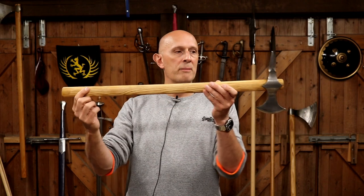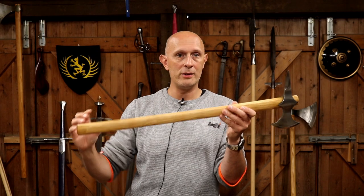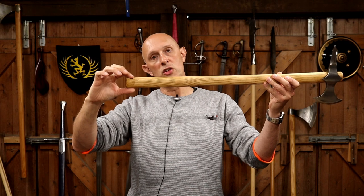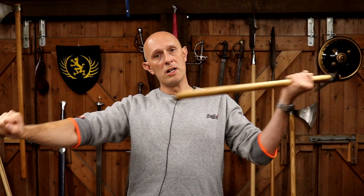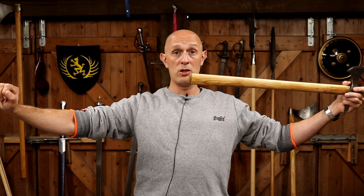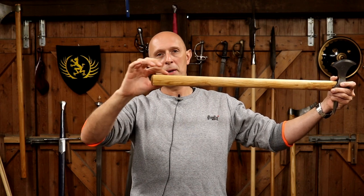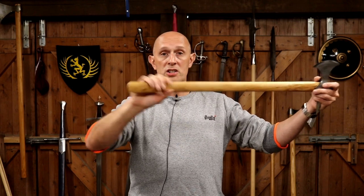One final detail: if you use this sliding-up construction method, much like a pickaxe handle, the top of the shaft is fatter than the bottom, but you usually need some form of flare out on the wood at the bottom end so your hand can't just slide off. If it's like a giant carrot or cone, your hand will want to slide off the end in use. So you make it thin and then just at the last bit you flare out enough — not so much that you can't get the head over it, but just enough to stop the hand easily sliding off the end.